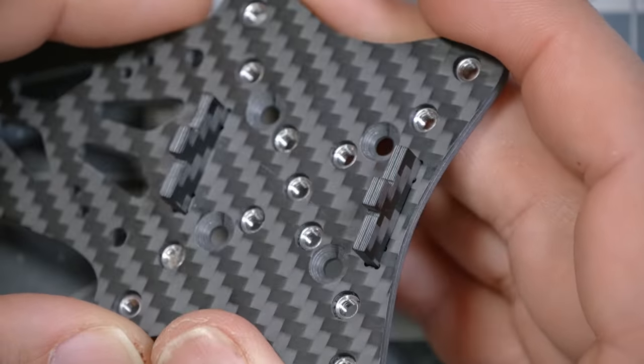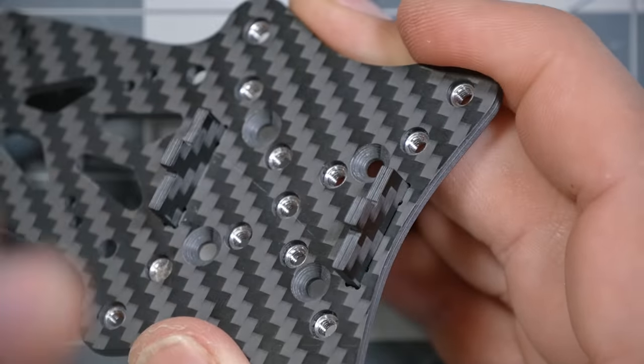It just depends on where in the sort of milling process they were, whether the drill bit was brand new and sharp or whether it was a little bit dull. The tolerances always change a little bit as you go through that process. And any frame has to be designed to take that into account. In a case of a part like this, where you need the part to fit very, very precisely, you basically make the hole a little bit small so that at the beginning of the run, the parts will be a little snug, but then by the end of the run, they won't be loose.